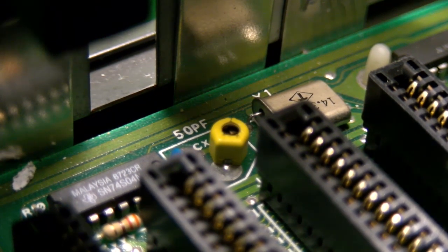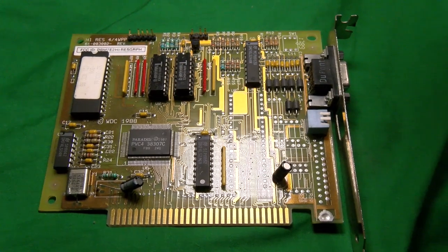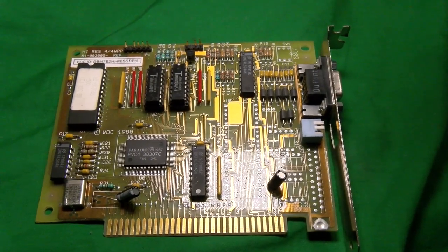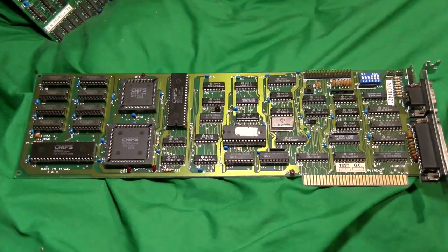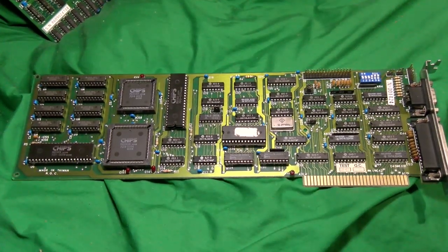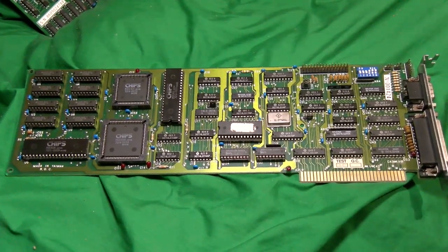Of course, again, this really is a CGA issue, and I only have one card that does that, and I'm not using it in here, but don't bother on EGA cards, because unless you have weird expansions for them, you generally don't get composite out. It doesn't hurt to try. Also some of them output Y and C separately on two sockets. So it really is a shit show of nothing really being quite standardised. I'm glad we ended up with VGA. It's just a much better technology than this stuff.